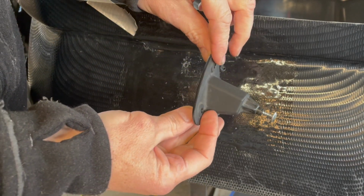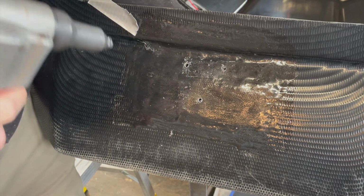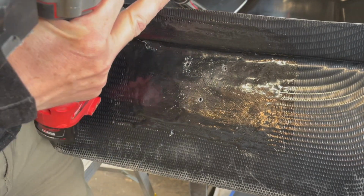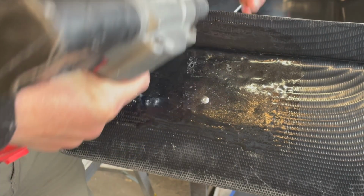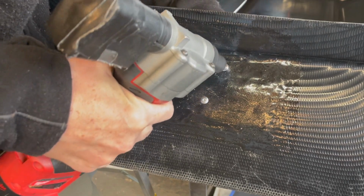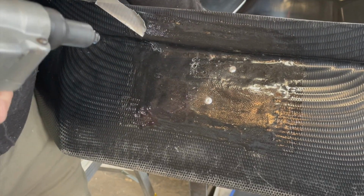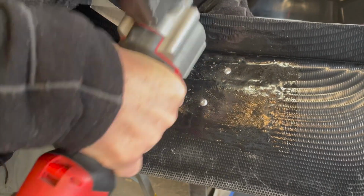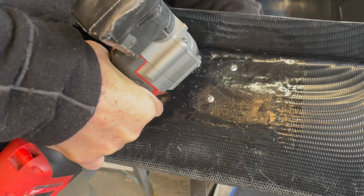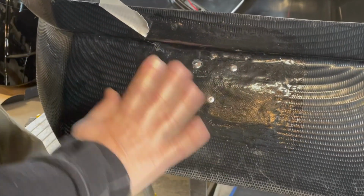And now I'm going to rivet this piece back on. I can see the configuration, how it's going to go. We're aiming for this hole on this, lining up the other holes. As I'm doing this, I'm also pushing on the plastic piece in the back with the rivet gun so it takes up any gaps. We don't want to initiate the rivet unless all the gap has been taken up. There we go. And pretty much that's the outside done.